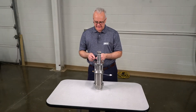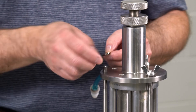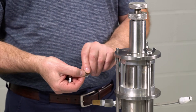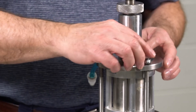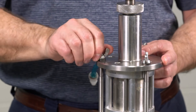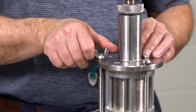We're going to go over the anti-vibration washer because one of the things I need you to realize is you can't replace this with a lock washer. A lock washer will damage the top surface of this top plate and then later on you'll have an issue with the wing nut not tightening correctly. The anti-vibration washer has a coarse side and fine sides — the two coarse sides go together. When you tighten these, keep in mind it doesn't need to be super tight, just snugged. When you go to loosen it, it's going to snap — that snapping noise is what locks it into position. If you over-tighten it, somebody else who takes this apart may have issues getting it apart.